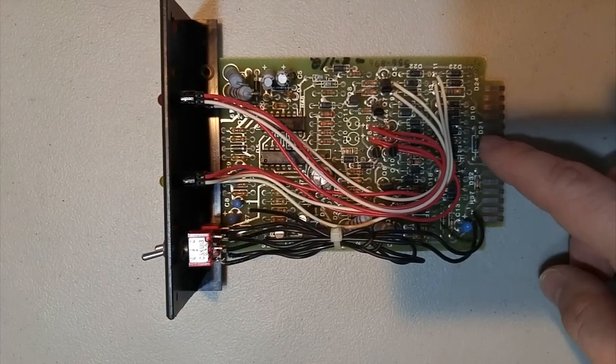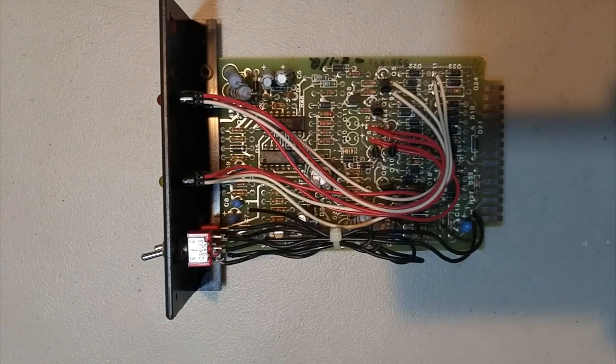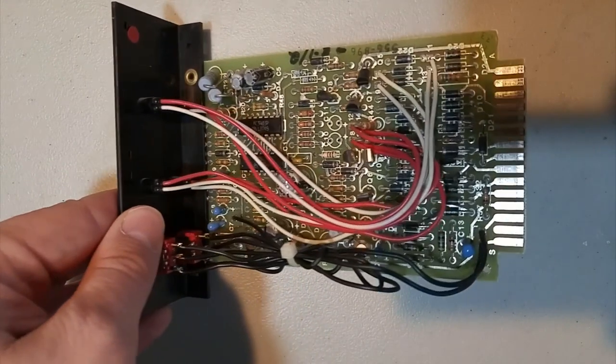And when you acknowledge it, it applies power, which turns on a latching circuit inside the zone card, which causes the LED to stop blinking, which is rather cool. And the next card, the LED would blink, it would go solid, and so on. So that's how the zone card works, and some of the control circuits inside the panel that go between all the cards.